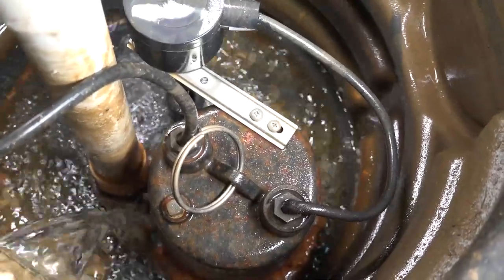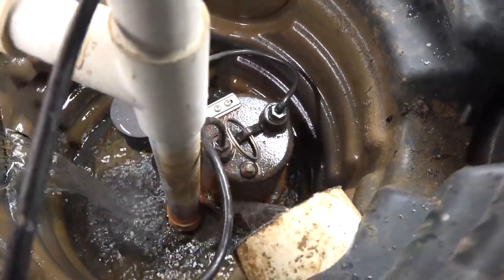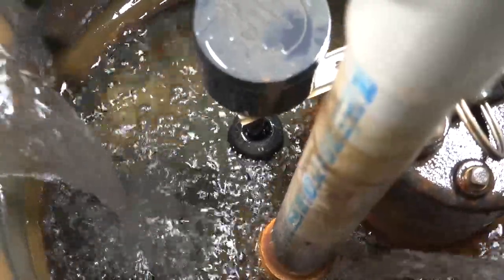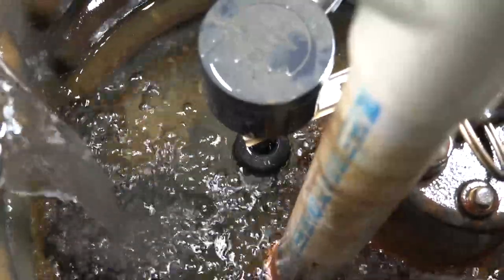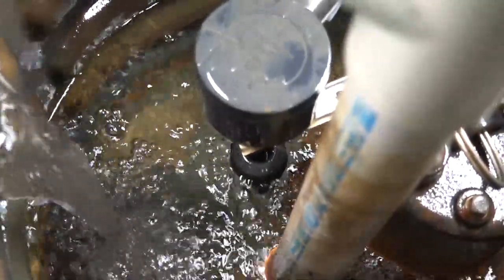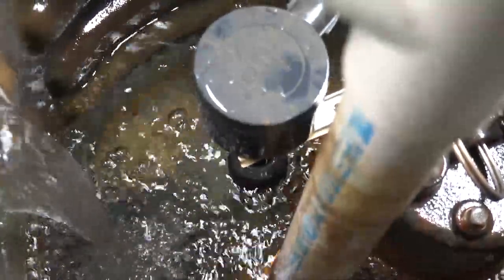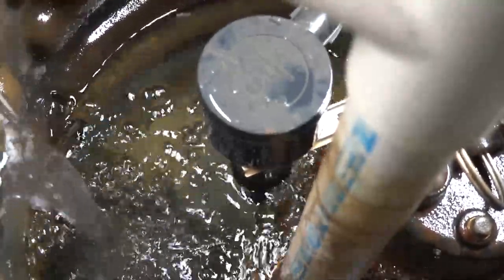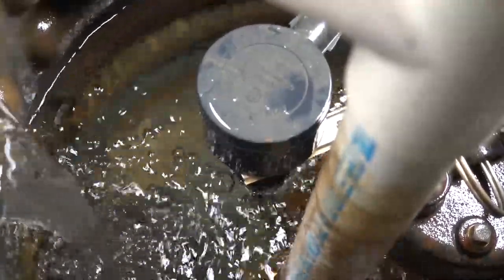All I can do right now is unplug it to shut it down. If you're hearing that sound from your sump pump, the good news is it's running — the worst case would be it doesn't start at all. After you unplug it and plug it back in, the little float turns it off. But I can't be there all the time — the whole purpose of a sump pump is to save your basement when you're not around. I bought this Superior pump switch from Amazon and I'll put a link in the description. It's very inexpensive — about twenty-some dollars.